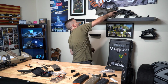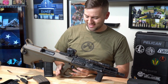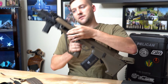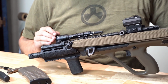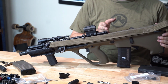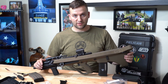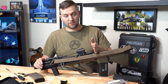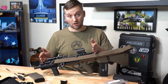So, what it's going to look like is similar to what I have here. This is an AUG A3SA by Sabre Defense, and this currently has a 30 slot top rail with a gooseneck extension. That is, the last 10 slots of what could be pick rail are flattened out to take a weapon mounted light switch, which is the natural position for the thumb to rest if you're clamping further out. The rails can go as far back as here before you start poking your eye, and they can go as far forward as your muzzle device or your own personal preference requires. Right now what we're looking to do is to create 40 slot top rails that start flush with the ejection port and end right behind the jam nut of a stock 16-inch AUG barrel.